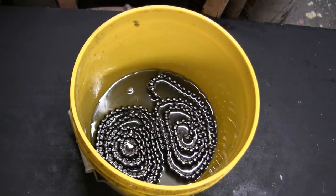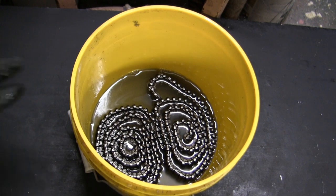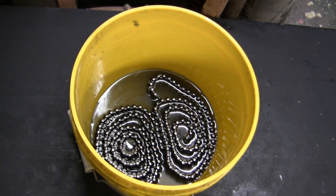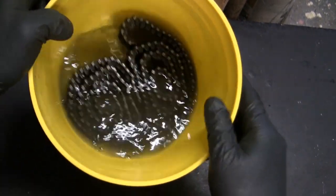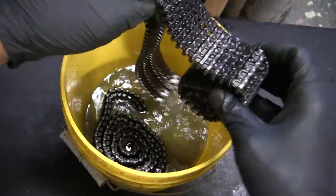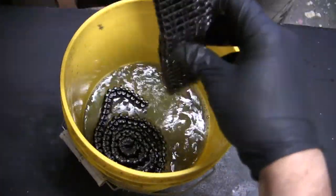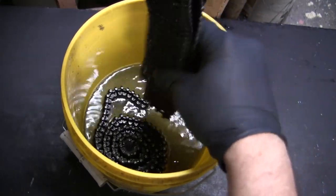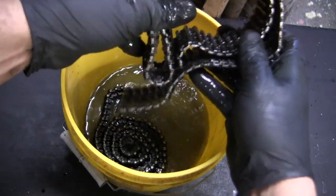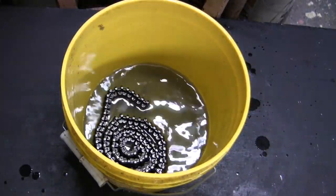The procedure is a fairly quick one. In about 5 or 10 minutes, or about 20 minutes or so, you should have enough of the residue off where you can take the tracks out and dry them out thoroughly. And that's exactly what I'm going to do here. So I'm just going to grab the tracks, shake off any remaining residue, or I should say any remaining paint thinner, and I'm just going to set these aside and let them aerate out.